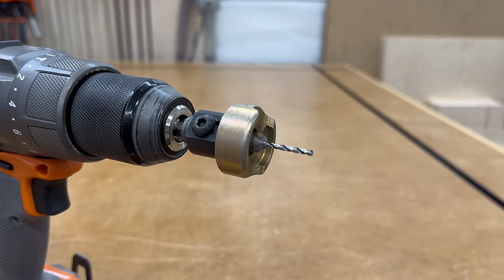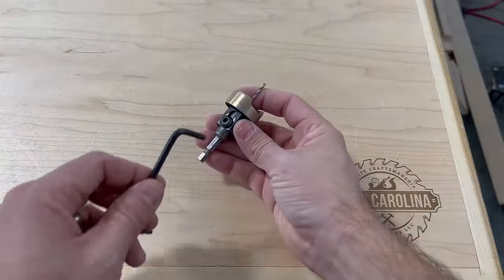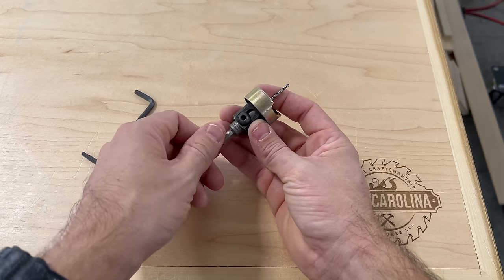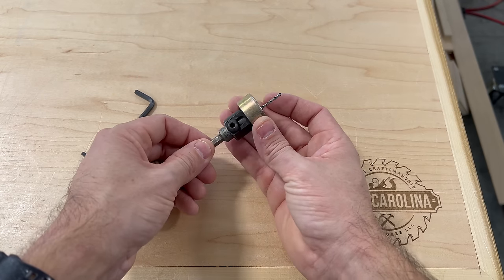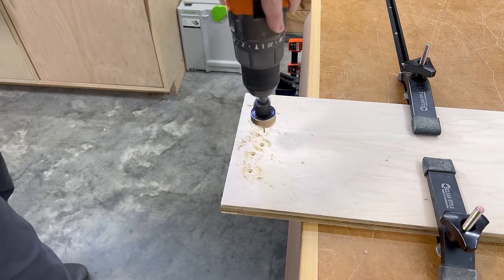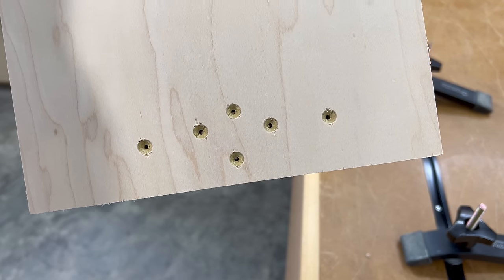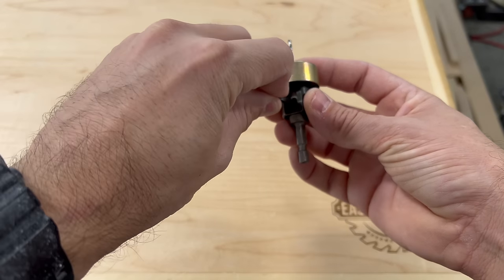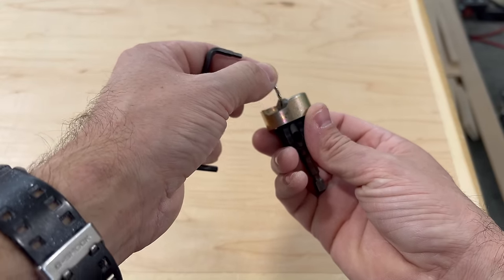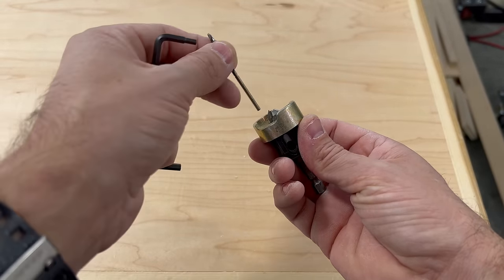every single day. I'll bring you guys in for a closer look so you can see it in action. This thing has an adjustable depth stop that allows you to drill at a consistent depth every time. You can make these adjustments to accommodate multiple different screw sizes as well as different depths of the countersink hole itself. It's super versatile and can meet any of your needs. You can also change the depth of the bit itself so it doesn't matter the thickness of material, this bit has you covered. And when you wear the bit out, it's easy. Just replace it with a new one.